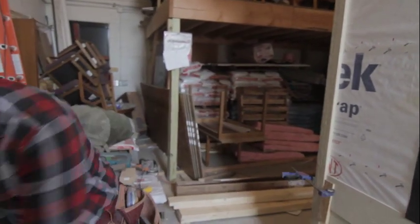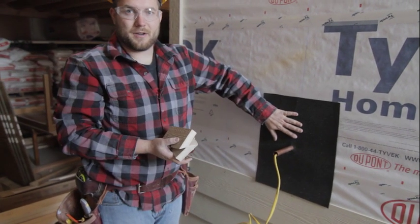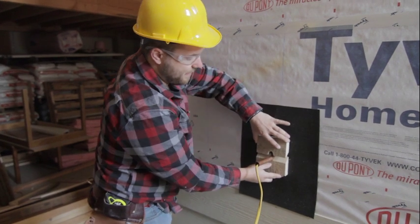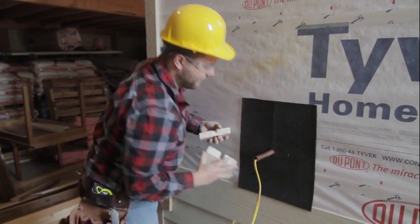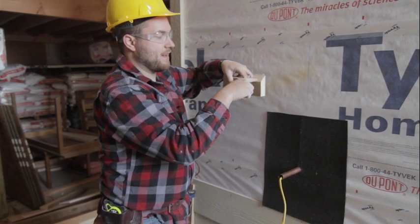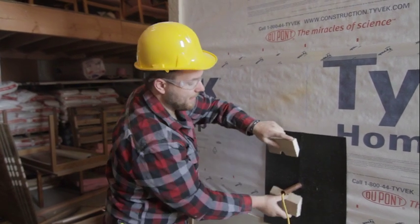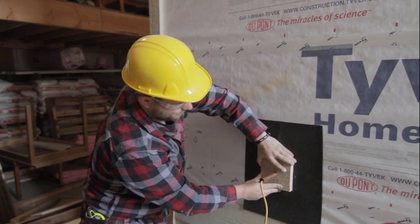The second part is putting on our trim piece. It'll trim things out, and if you have something like a hose bib or something bigger like an electrical box, you'll have a flat surface to screw back onto. What I have is a piece of trim board — I drilled a hole through it first and then cut it at a 45-degree angle. That way, water would have to go uphill to get behind the piece. We'll also put a little silicone bead in there, making it pretty much impossible for water to get back behind. The 45-degree cut goes right through the center of the hole, the top piece goes back on, and then we'll screw it shut.